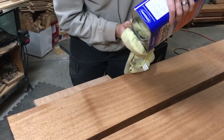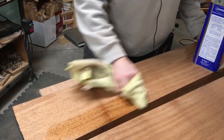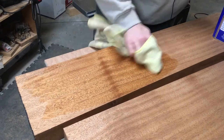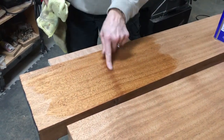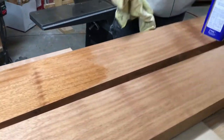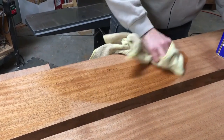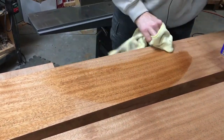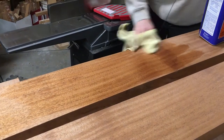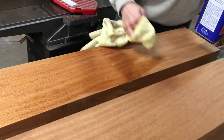There is a trick to be able to see what kind of grain you're really dealing with. Sometimes things aren't immediately clear — we planed it off first, which helps some — but if you take alcohol, you can see how the grain really pops out. This is that number eight piece that has this arc coming through it, a little bit different. The number seven piece — this is upside down — goes this way with the top here and the bottom here, accounting for this arc. This is the part we avoided altogether. You can see it's kind of wild and chewed up on the back and didn't go through the planer nicely.